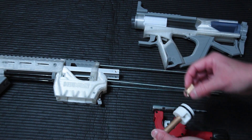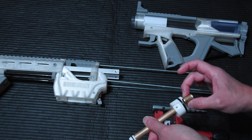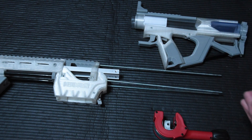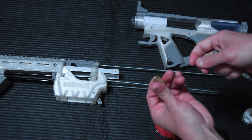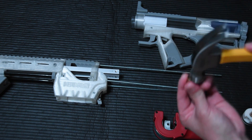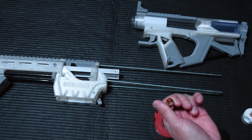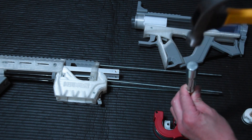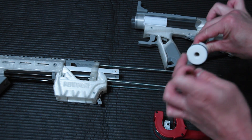This rounded edge will allow it to work its way through the ram base, which you don't want. What you need to do is swage the outside so it has a wider lip that prevents it from pushing through the ram base as it gets impacted over and over. You use the swaging tool while this is inside the ram base, then hammer it until the edge flares out. That will keep it from passing through. Once done, finish the edge a little bit — knock down the edges — until you get a nice little lip on the outside, with no burrs on the inside.